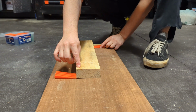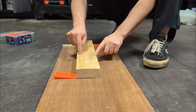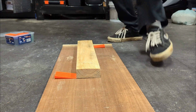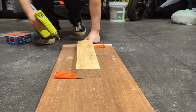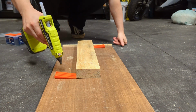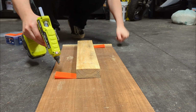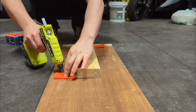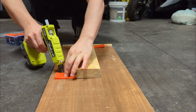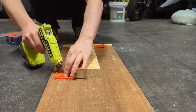then lightly chock under the board so it's stable and doesn't flex. Once the board's solid, we hot glue it and the wedges into place and run it through the thicknesser taking shallow passes. Now, this can be very time consuming, so much so that one starts to see why more people don't use this so-called free wood. Doing each board individually drives me insane, so if anyone knows a quicker way to do this, please let me know in the comments.